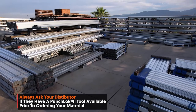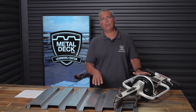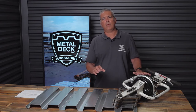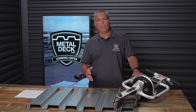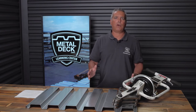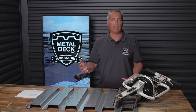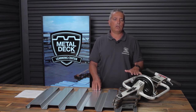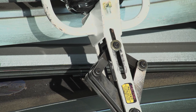One final note about the Punch Lock 2 system is the lack of availability of the tools. Both the manufacturer and metal decking distributors really do not have a lot of these tools. They go out on a combination of first come, first serve, and size of the job. If you have a larger job, you're not going to have a problem getting a tool. However, if you have a smaller job, the distributor or manufacturer may have to prioritize and it could delay your job — you might be 10th or 20th in line. Buying from a distributor, at about 20 squares or 2,000 square feet is when it no longer makes sense, and you should try to get the deck specified as non-punch lock.